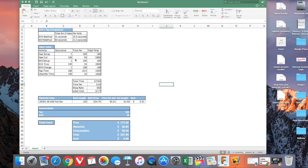We're talking about a quantity of 100, which is what he had asked for. So 5,900 seconds for all the cuts. Setting up the mill: 106 seconds — again a one-time occurrence. To drill all the holes: 33 seconds each, so 3,300 there. To change over the mill — a one-time occurrence to go from drilling to tapping — 108 seconds for that.